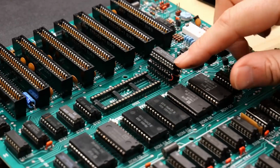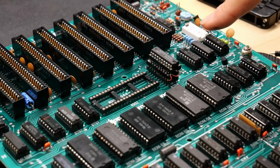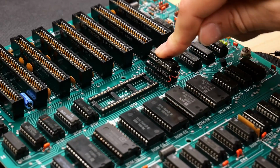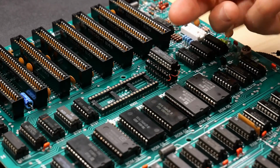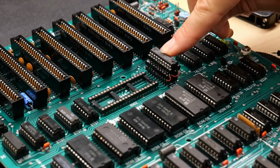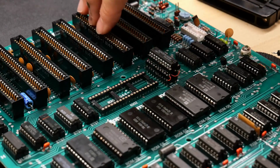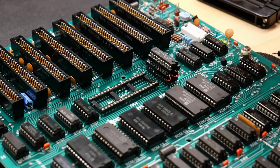So there it is in the motherboard. It's a little bit of a triple stack. Obviously, I could have eliminated one socket by soldering these wires and bending pins directly on the IC, but that would have made it a permanent thing in there. And at least with this, if I ever get one of these original 8304s, I can actually put this back in the motherboard, eliminate this adapter, so there's no permanent changes. And then if the 245 ever dies, well, then I can also swap that out because it's not soldered into the socket. But it ends up with this little bit of a tower here, and theoretically, something plugged into slot 5 here might interfere with that. It's possible, just depends on whatever's on that board.